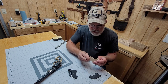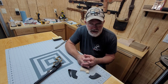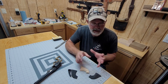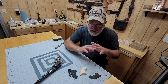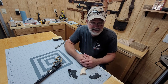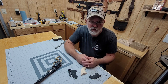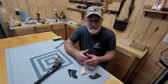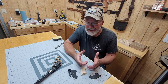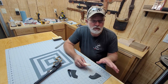I may tinker around with these a little bit and see what I can do. But the little copy-carve machine I made is not quite right — there are some issues with it. One is with those drawer slides: sawdust gets in there and makes it drag a little bit. You don't want that; you want it to move as freely as possible. There is a little bit of flex in it, which is really bad because you can mill too much away or not enough if there's that much flex in it. So that's version 1.0. There will be a version 2.0 that will be made more rigid and probably more like the traditional ones. There are commercial units available, but they're pretty pricey, so I don't know that I want to spend that much money on it just to make a couple grips like this.